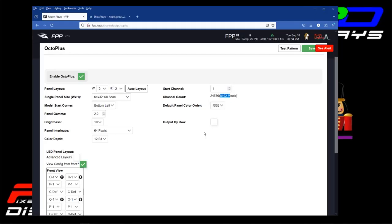If you use the default settings with a lot of those cheaper panels from that time, you would get ghosting. What would appear on one line would ghost slightly onto other lines. So we had to do a lot of little settings here just to work around that. You can't really fault the vendors because they were able to find components and produce panels, but they weren't the same quality of what you would probably be getting from Miner or our other vendors today.